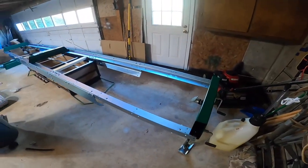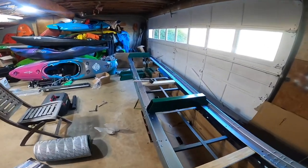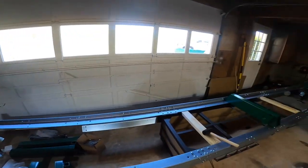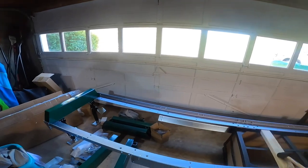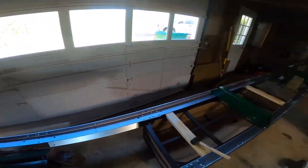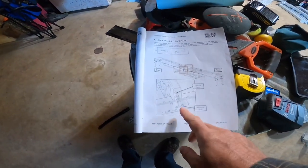Good morning YouTube, day two. Pretty happy with everything I got done yesterday - started in the late afternoon and got the whole rail assembly pretty much put together with temporary jacks. I just checked it for square doing the cross diagonals: one half here, one half there, and then the whole length to double check. Everything's good and square.